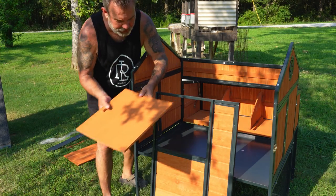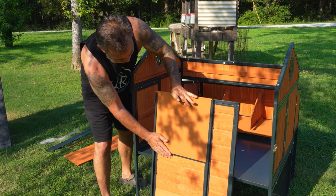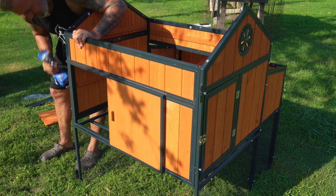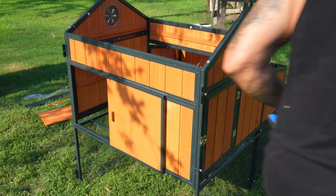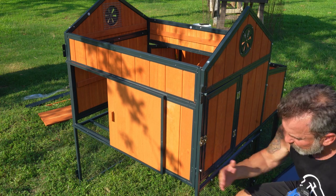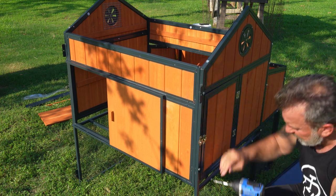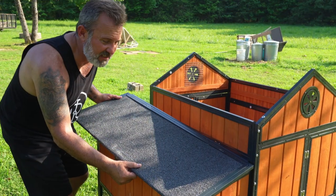Take part 13, the front, and get your door - part 14 - slide it right in the hole there so you've got a door. Slide it all the way over and it is open. Now we can install it - tighten up the 30mm bolts on either side. If you have trouble getting this in, what you might want to do is take out the tray and loosen the last tray support bolt. That will allow the frame to open up a little bit so you can slide it in. Get these tight, then re-tighten that support bar.